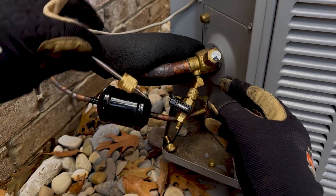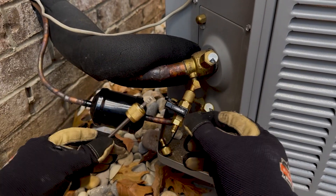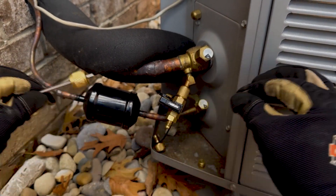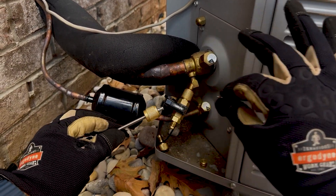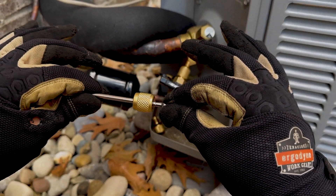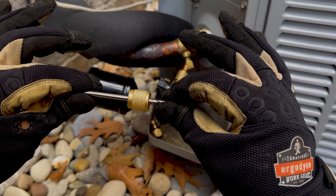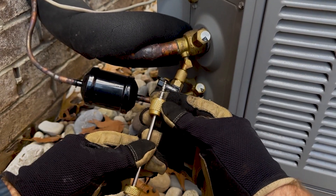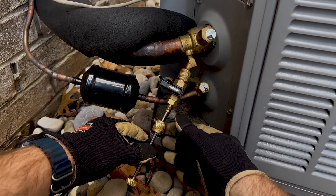Close the ball valve and remove the plunger, which reveals the schrader core intact and secured on the end — it does a very good job at that. Put the new core on, click it in — it has a really good positive grip there. Then we're going to reverse this process and thread this back onto the tool.